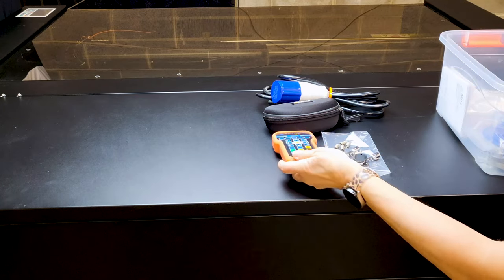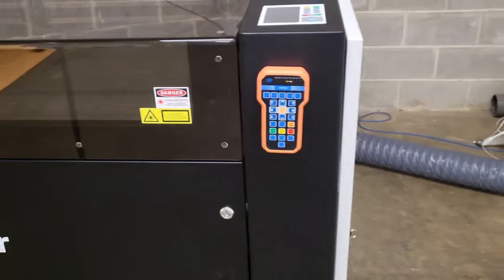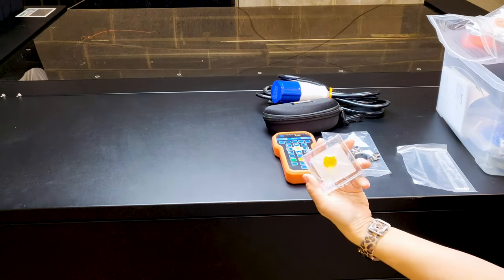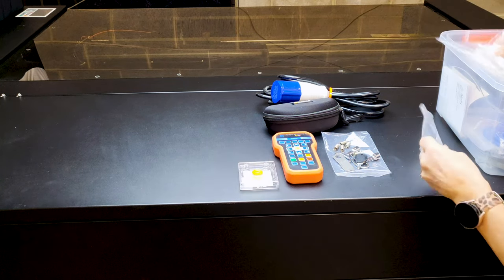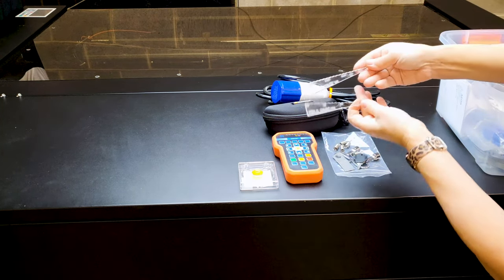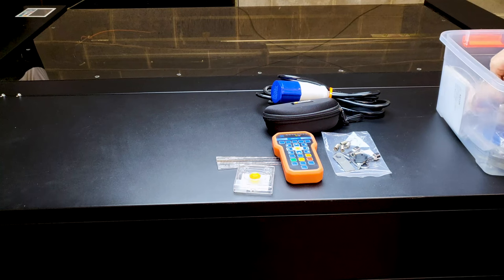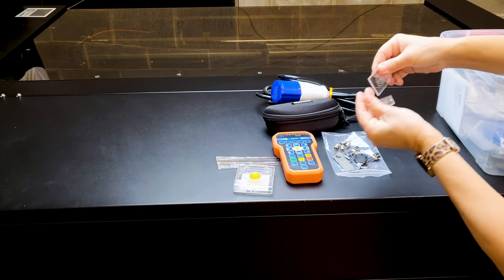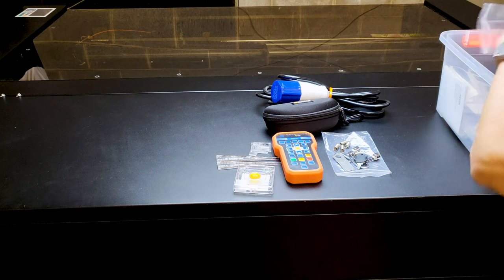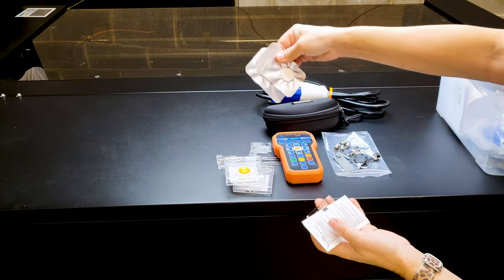I think this thing is my favorite — the little remote. It's magnetic and sticks to the side of the machine, doesn't really move, and it's wireless. These are extra lenses for different focal lengths: two, two and a half, and four inch. These are little guides for setting the z-axis — a manual focus option, though it comes with autofocus. These are little targets for helping you line up your mirrors; we hadn't seen those before and they were a great help — invaluable in aligning the laser. And there are extra mirrors too.